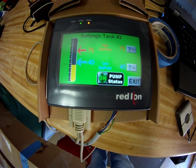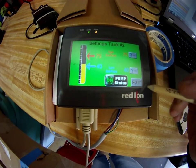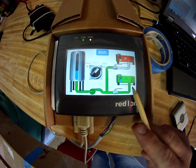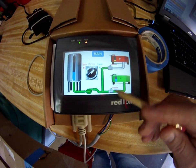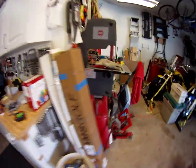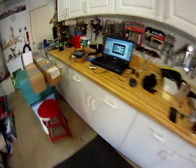At this point the pump would be filling up. As I move it up, I go back to the main. You can now see the plumbing — the green flow indicator is here going up, but this valve is supposed to be closed and this one is supposed to be open. Again, we don't have any feedback; the operator must have it in that condition. If I go over to the outside tank, you can see that the relay is on out there — exactly what we want.